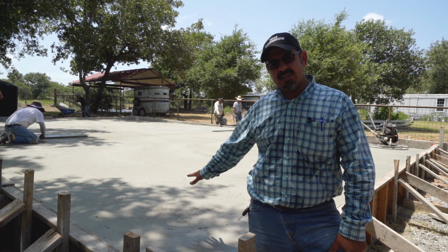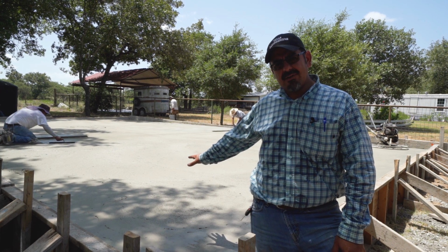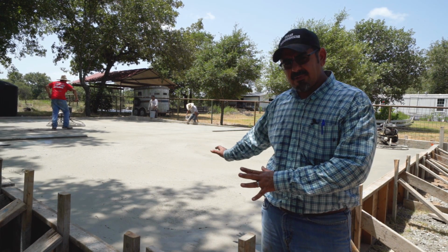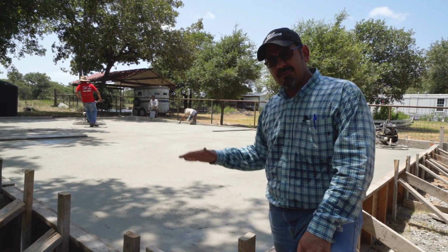This is going to be a broom finish surface. That one's going to be slicked off. The sun's already out. It's getting pretty hot, so I'm only going to pan it twice because I don't want it to get away from me. So now let it sit for about 5 to 10 minutes, or however long you need, depending on temperature, and then come back with your combo blades.